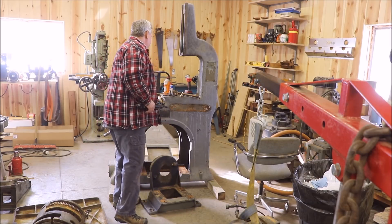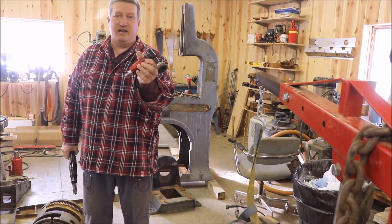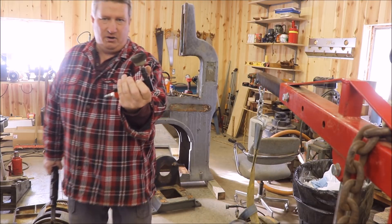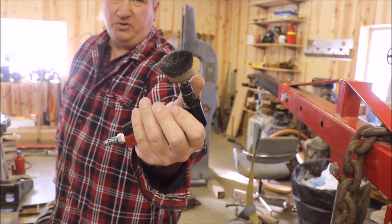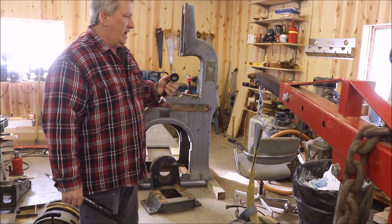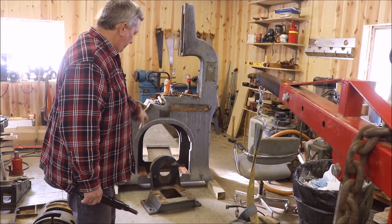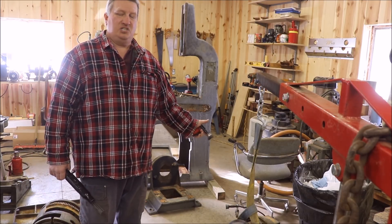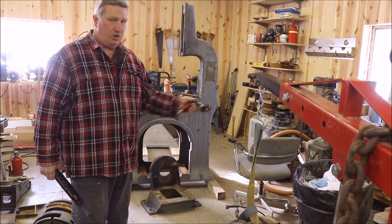When I'm done with the needle scaler, I'll go to work with this die grinder - a 20,000 RPM air die grinder. I have a little wire wheel on there right now, which is really good for getting into little tight spots and cleaning up rusty surfaces and mating surfaces before repainting. I also have Scotch-Brite pads that fit on the end in little three-inch discs, so I can get in there and polish up surfaces like the pads where the motor mounts are - those are machined surfaces that have to stay clean.